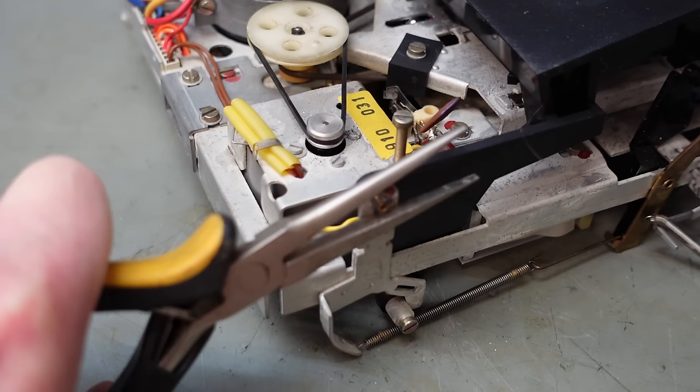There's supposed to be 0.3mm of clearance between the bearing and the freewheeling mechanism. Yeah, I guess there is. If I can pull the spindle out of here, yeah, I've got it. And this will all fall apart. And it has.